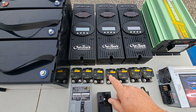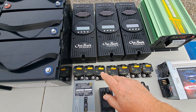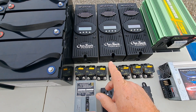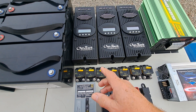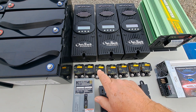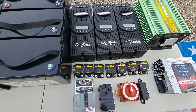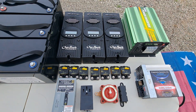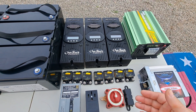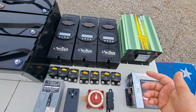These are all of the circuit breakers that I have to protect the charge controller from the batteries and from the solar panels, also for disconnect as well. I have three 30 amp and then I have four of the 80 amp circuit breakers. Again, using those as a disconnect as well as protection from shorts and surges.